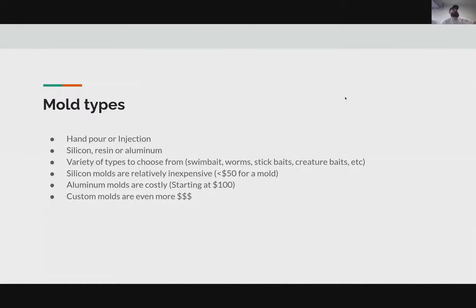You can. So you can remelt baits. If you're going to do that, I would recommend using some worm oil. So you can chop them up into smaller pieces, add a little bit of worm oil, and then heat it up in the microwave. Again, you don't want to get over 355 or 350 degrees. So kind of just go through the process slow. But yes, you can definitely remelt plastics.